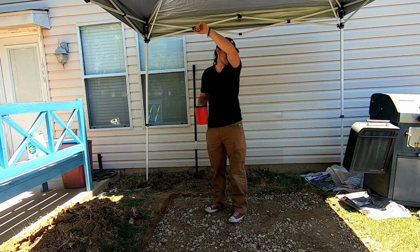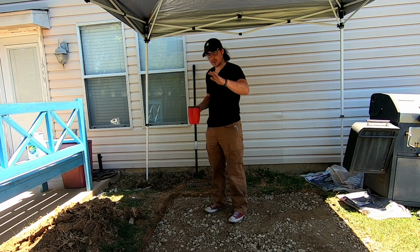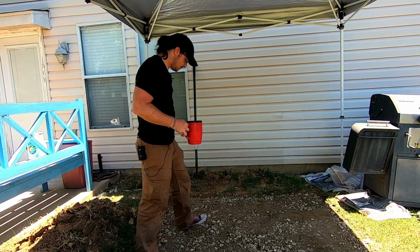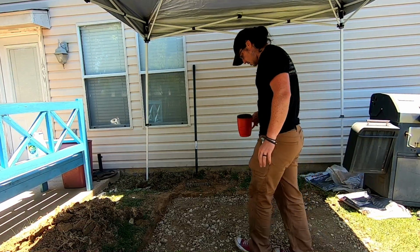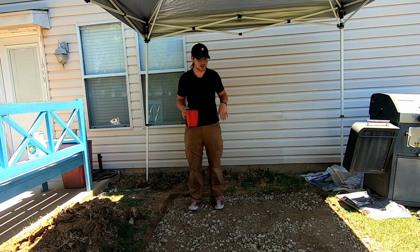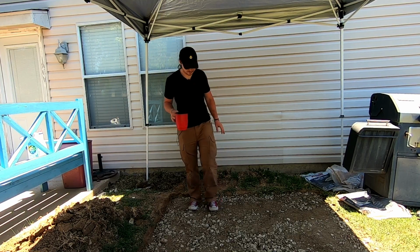This nice shade, it is still super hot outside, but we're coming along. We got the paver base put down. It's not perfect. There are some voids here and there that I would like to fill, but paver base isn't the most accurate thing in the world. I'm really hoping that we can get the bulk of it leveled out today, and then I can come back and fill some of those voids with the sand that goes in between. The base is what's going to actually give it the structure. The sand is supposed to keep it from twisting and making the joints go bad.